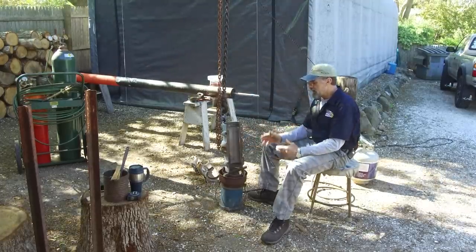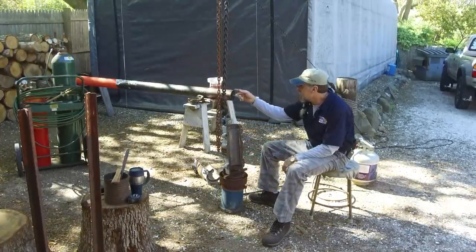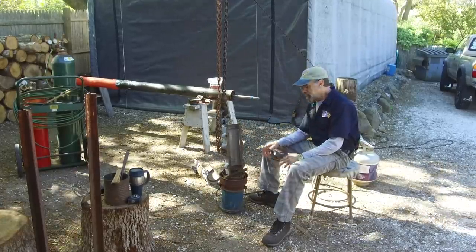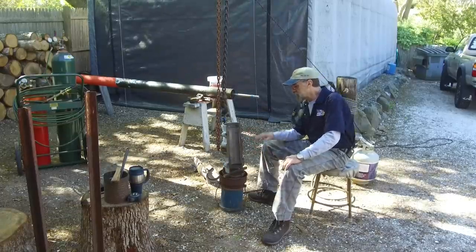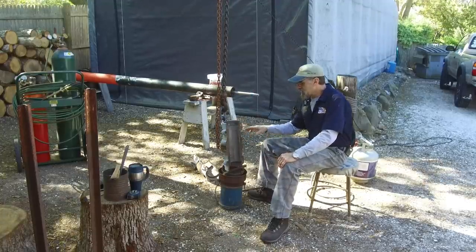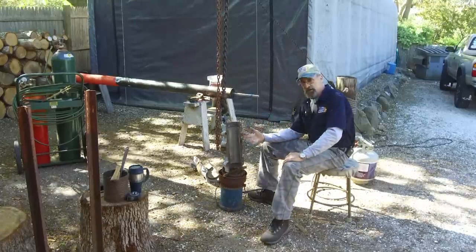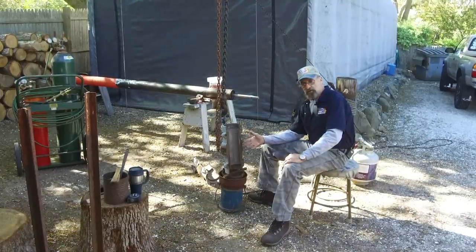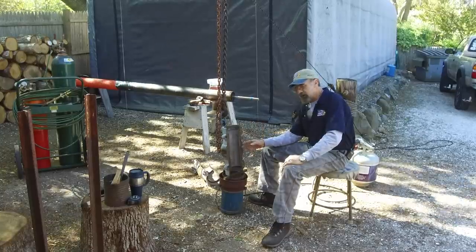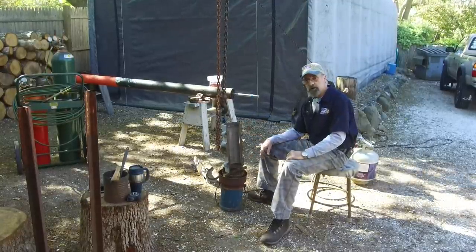This large self-aligning bearing is a pretty good size. We have our melting pot down here and we're going to take the torch and melt this out down into the pot. We'll fire off the gas, clean it up, and salvage what Babbitt we can out of this project. We've got both shells - the top and the bottom. After that we're going to bake the castings to get all the impurities and oils out, dry it out, then tin it. Then we'll turn a mandrel that's going to be our dam and create the cavity we want to pour.